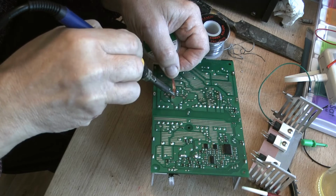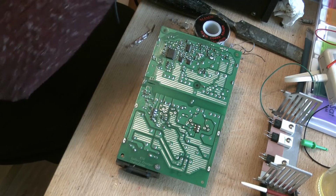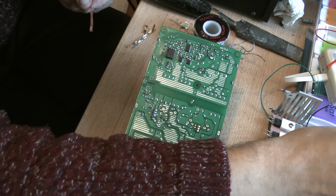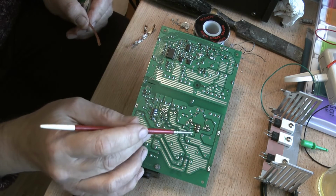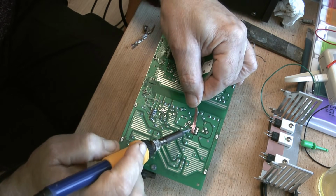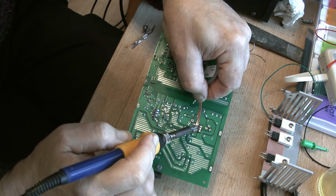And burning off and leaving a horrible residue. And that is because it's too rich in rosin, I think. It may be the varnish on the board that's causing the problems, but I don't see much damage from where I've been doing all the desoldering, so I presume it's the flux. And well, I never used to do that. I think it's just the concentration of rosin and alcohol, just too rich in rosin. 5:1 seems okay. A little bit more. Right.